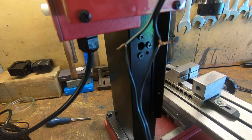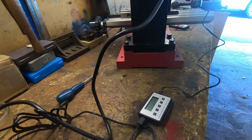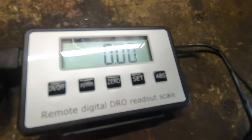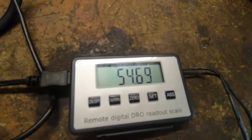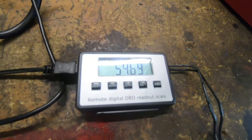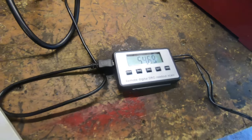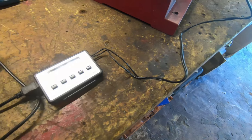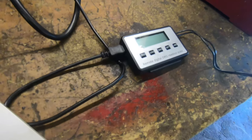I've just twisted the two output wires, which we now hope are carrying 3 volts, loosely together. I'm going to quickly turn this on — I've taken the batteries out — and that's looking very healthy. When we move the slider on the DRO that seems to be doing its job. We are now using 240 volts, via 12 volts, via 3 volts, to drive our DRO. So now I can crack on and fit the mechanical slider itself. Let's hope nothing gets hot or blows up — I'm just feeling the back. There doesn't seem to be any excess heat being generated. I think I'm cautiously going to call that a nominal win at this stage. We'll see how it lasts over time.